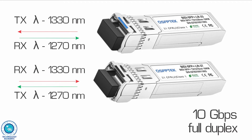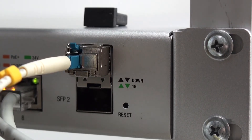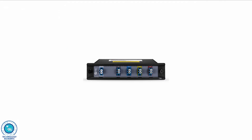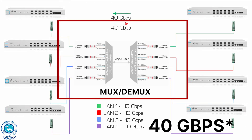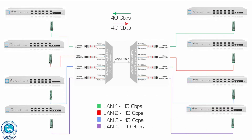They use and share the same media for sending and receiving simultaneously many trunks, and even without being on the same network, it may very well be worth the investment in these devices. These concurrent connections, without having to implement 100 Gbps trunk switches, are going to be using 80 Gbps bandwidth in either direction or even simultaneously using one single optic fiber core, but none of them surpassing 20 Gbps each.